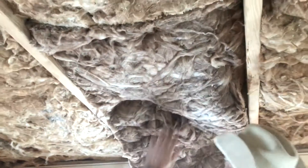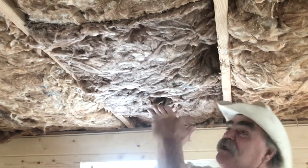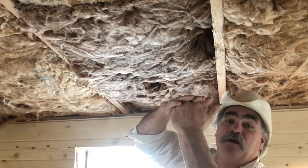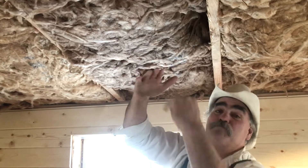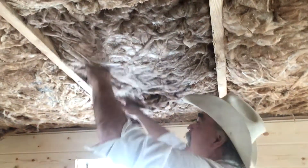This is the cheapest roof I'm aware of and it's actually legal. When I push hard to get this insulation in there, I know I'm not pushing the cardboard back up against the plywood because of the spacer we put in. Right there — that is R-38. This whole lid is breathing.